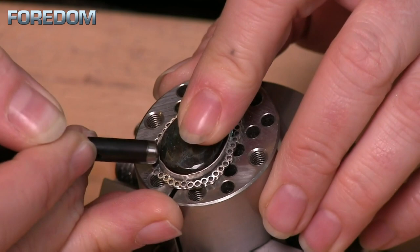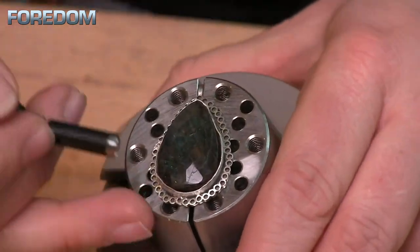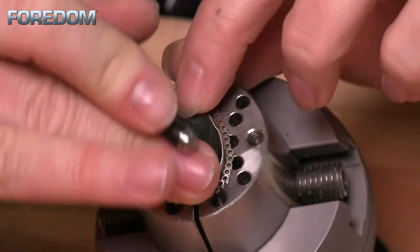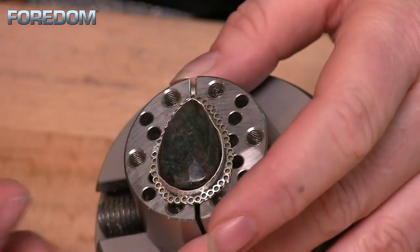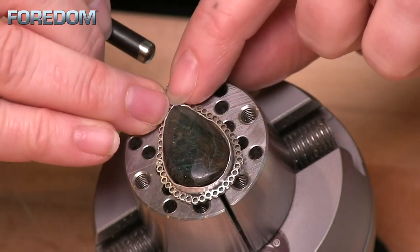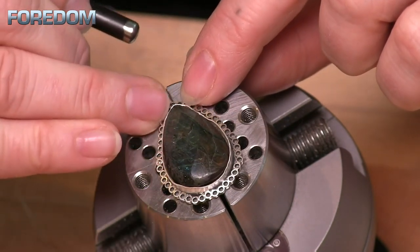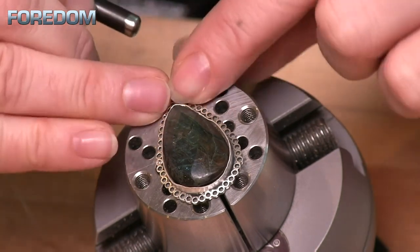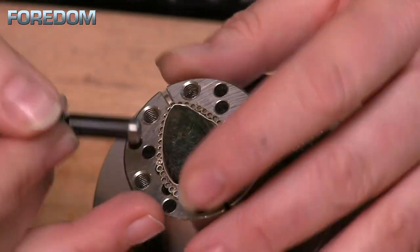It's just what you prefer. I like to make certain that I stay in good control as I'm doing this. Now that I've got multiple points set, my stone has no rocking, no moving, nothing like that. I like to work away from a point, and I always set that point very first. Anytime I have a point, if I were to bring this to the point, I'm going to bring too much metal up here and it's going to be really hard — I won't be able to get that to lay down nice and smooth around that point. Always set your corners first.